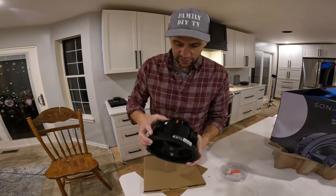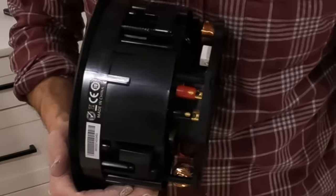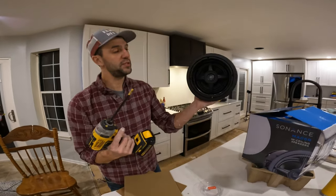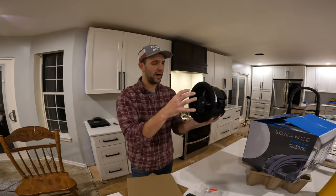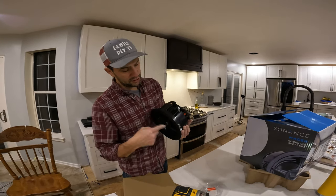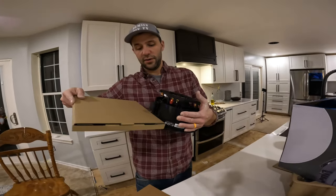This is where you connect the wires. It's actually a real easy connection — all you do is push this down, put your wire through, and let it go, and it's connected. So real simple. To attach this to the ceiling, you put it in there and then you have four Phillips head screws that you need to tighten. Basically it's kind of like an electrical box — once you put it up there, you take this and put that in there and it spins over, and the more you turn it, the further this comes down, and that squeezes the drywall between there.